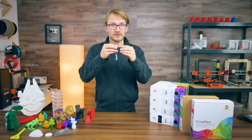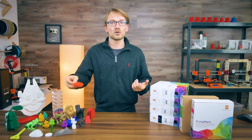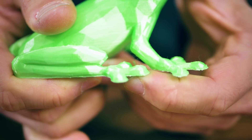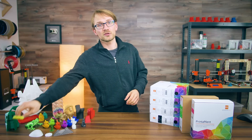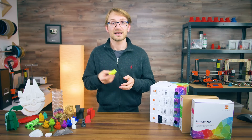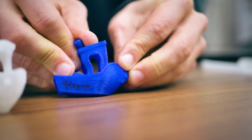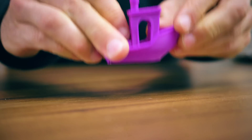Let's touch on stiffness vs. strength. High modulus — stiff materials like carbon-reinforced plastics or even just PLA — will produce much more rigid parts that flex less under the same loads than a low modulus material, but it won't necessarily make for parts that withstand greater mechanical loads or take more abuse before breaking. Quite the opposite, in fact. Stiff materials will tend to be more brittle than softer ones, and having material that can flex slightly means the part can recruit more material along its cross-section to spread external forces over a wider area. That's the exact reason why parts printed from fully flexible materials, or even from materials that are just slightly elastic like nylon-based ones or even polycarbonate, will feel much more robust than a fully rigid print — and they are. So my advice: for a print that might see some rough use, pick the softest material you have that is still able to support the loads you're expecting.